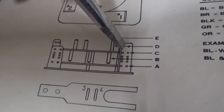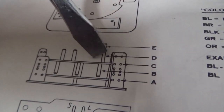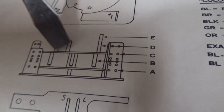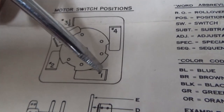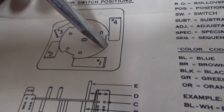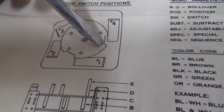See how it's folded up? Basically, it's a piece of the metal that's folded up. And C is on that top plate. The bottom plate is the impulse plate. It has five bumps each home position. The top plate has one hole at each home position. So basically, switch 1C opens at the home position. This is drawn on the home position. There's a switch right here that is open because it has fallen down into that hole. Okay, that's the one that turns on the motor.